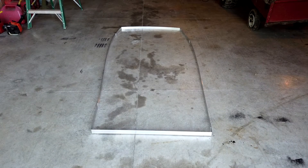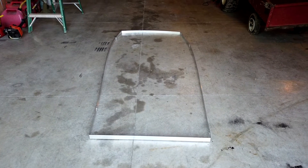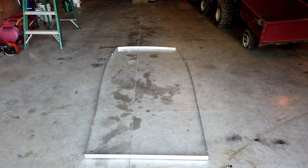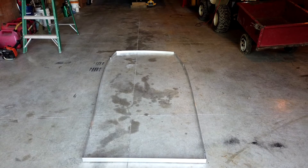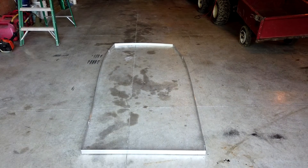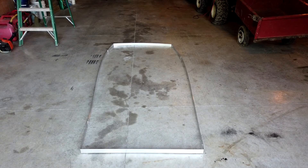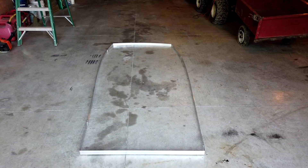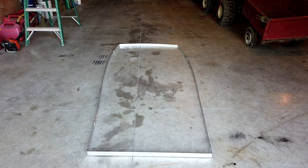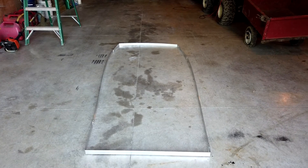Here's the framework that I've built for that window. It's going to go right inside of the brick. Before I had clips that I had to jam down into the cracks around the window, but this is just going to be right up against the brick on the outside edge. The top looks straight right now because I left it that way so that when you put it in the window, it has a spring force that forces it out against the sides and helps hold it in place. Plus I'm going to put a few screws into the mortar joints just to hold it in place.